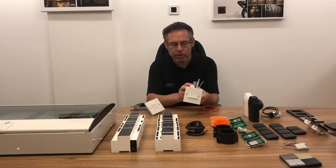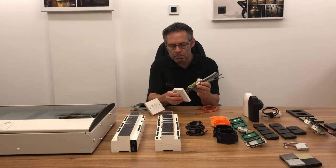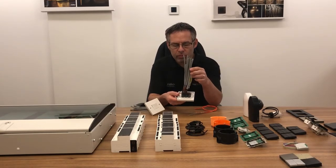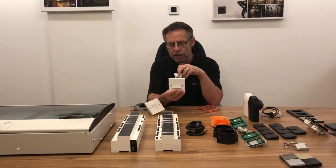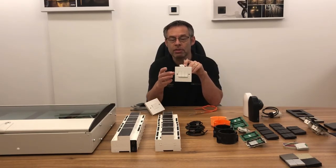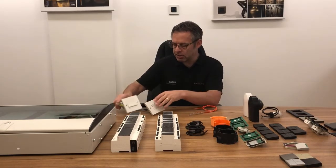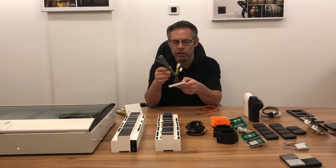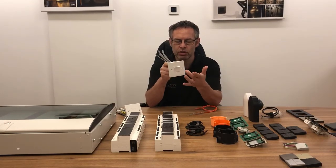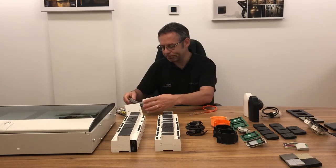This is an example of a 3-gang switch wired in a 2-way configuration, so a similar switch at the other side of the room. As you can see, there's a lot of cables there, which means a lot of time to chase these in, and of course to terminate. The upshot is that switch is only ever going to operate that particular lighting circuit. So we've got 3 circuits here, and you can see the cabling involved. This is a typical example again of a 2-gang switch, and as you can see, still a lot of cables. Similar configuration, 2-gang, 2-way switch, and therefore afterwards no flexibility.